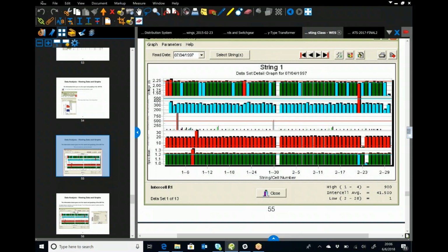It is a different plate design, and it is designed to dump its current as fast as it can and as much as it can to be able to support that UPS. And it's instantaneous. And to go off of what Matt's talking about, you have all sorts of different dangers when it comes to batteries. You've got acid. I'm still torn on whether I would ever put an apron on doing specific gravity or anything like that, because I know they've started coming out with FR safe aprons, but it's really hard to have acid proof and fireproof. The two just don't go hand in hand. So it's something to be really careful with.